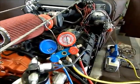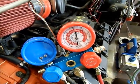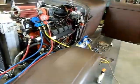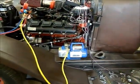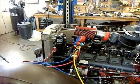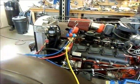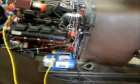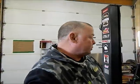Okay guys, we're back here. It's been actually an hour, and we're still sitting at 29 inches of mercury. The other one's the same, so looks like we've got no leaks. The next step now is to run the vacuum pump for half an hour to evac any air that's left in the system. It'll actually be nitrogen because that's what it was charged with, so that's better than having air. So I'll get that done, and while that's happening, I'm going to get to work on wiring and getting in the heater switches and stuff so this thing can get fired up.